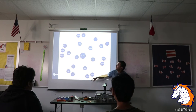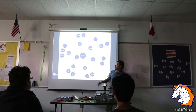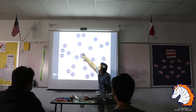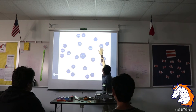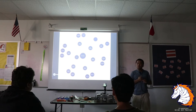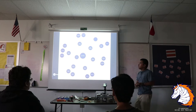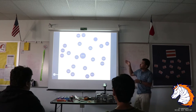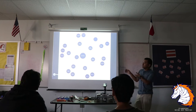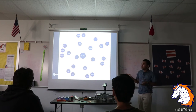We call our robot the omnibot because it's omnidirectional. You can see the PDM — the power distribution module — which is the hub with power and USB. From there you have a motor controller, legacy module, more motor controllers, and the robot controller connected to the driver station and joystick. We do this to know how many electronics we need, and it's really helpful for programmers so they have a visual reference rather than looking at a robot that doesn't exist yet. If something breaks down you know where it's connected.